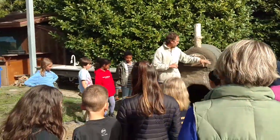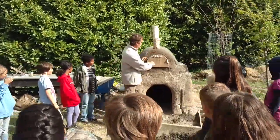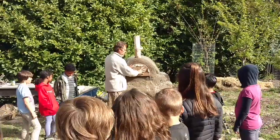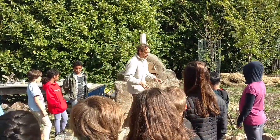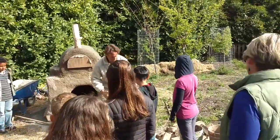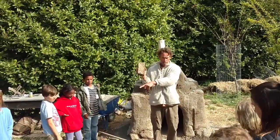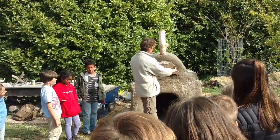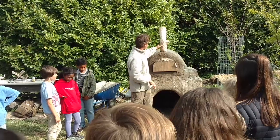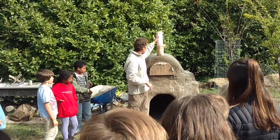And so yesterday, with a couple different classes, we worked on building this arch. I built this wooden form, and this is going to come out, and we made these adobe bricks. We made some adobe bricks using this earth and sand, and put those adobe bricks over the form, and put this little temporary chimney mold form in there also. This is going to be coming out.